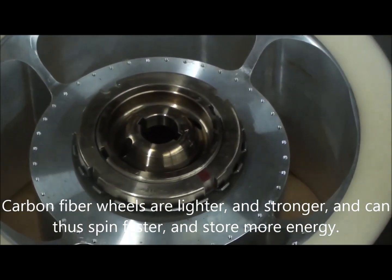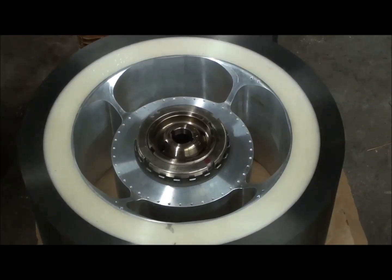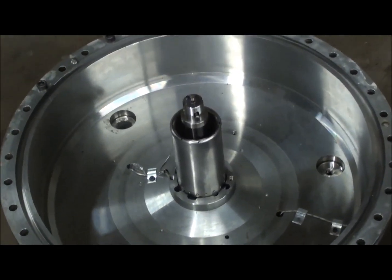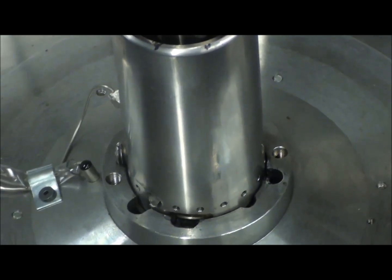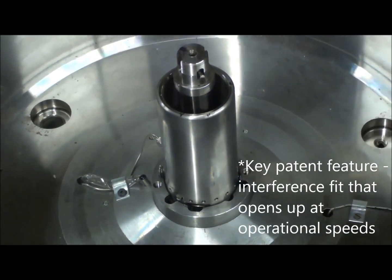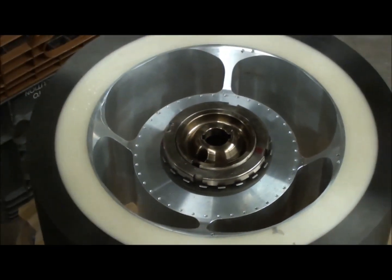This whole flywheel assembly on its hub, with the flex lift attachment system on the inside of the aluminum hub, is mounted in the top of the flywheel containment here, over this cylindrical surface — very precision ground, accurate to a few tenths of a thousandth of an inch, with a one or two thousandths of an inch interference when stationary — and fastened to the shaft by means of this lock nut and lock washer.